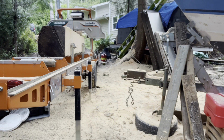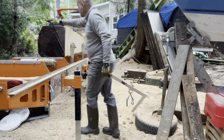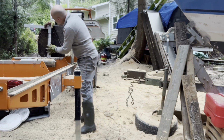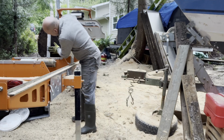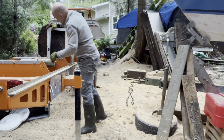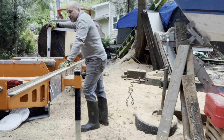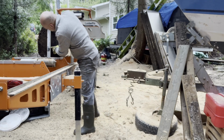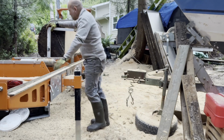Use the square. So this top edge will still be unsquare. I gotta take a slice off of this to level that out, and then what we got left? We have 15 1/4 inches. For the 6x6s, they're actually 5.5, so I need 11. The two of them, that leaves me with 4 inches. So I can take a 4-inch chunk off the top.